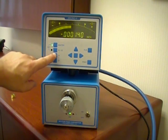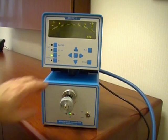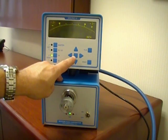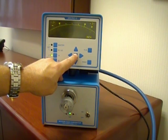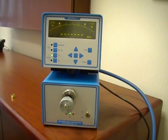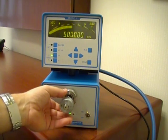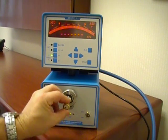The next step is to press the gauge 1x mode. The display will flash. We will go into the auto zero mode and zero the air spindle to the gauge by pressing the center button of the five key array with a double click. The display will go to bars for approximately three seconds, then return to zero.